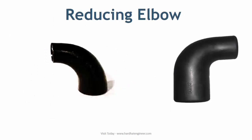The next is reducing elbow. The 90 degree reducing elbow is designed to change the direction as well as reduce the size of the flow within the piping system. The reducing elbow eliminates one fitting — the reducer — and reduces welding by more than one third, saving two circumferential weld joints. The gradual reduction in diameter throughout the arc of the elbow provides lower resistance to flow and reduces the effect of steam turbulence and potential internal erosion, preventing a sizeable pressure drop in the line.